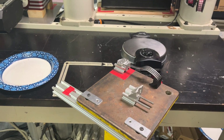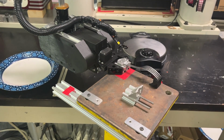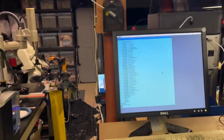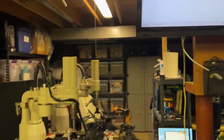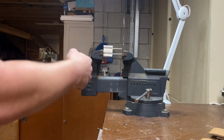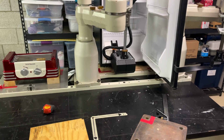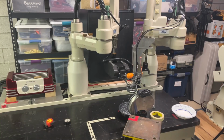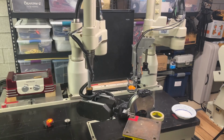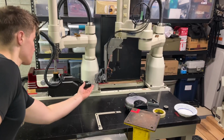for every run. My first ideas were to obviously use some sort of compliant mechanism to grab the egg, since every egg is a different size, but this proved to be too complicated when I could just use a simple fork mechanism by pressing these 2 rods into the small piece of aluminum extrusion and just kind of fork it and roll it off to where it needs to be, which proved to be a much more simple, reliable solution. Now I need a way to grab this tool without it slipping or sliding and always being in the same spot on the manipulator.